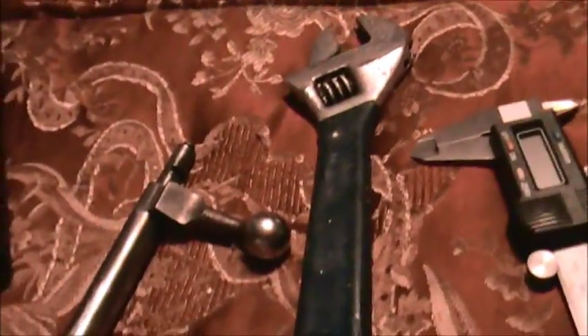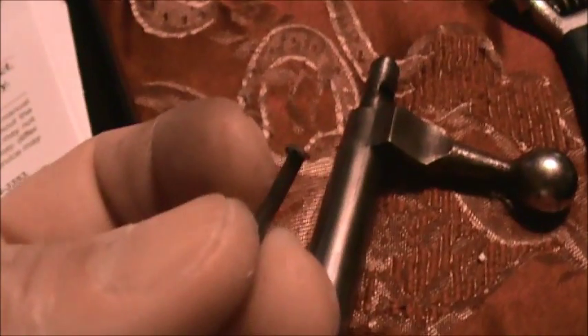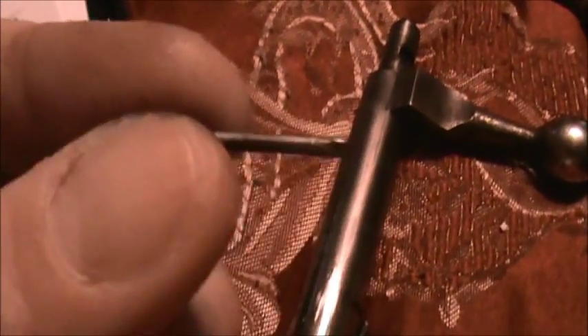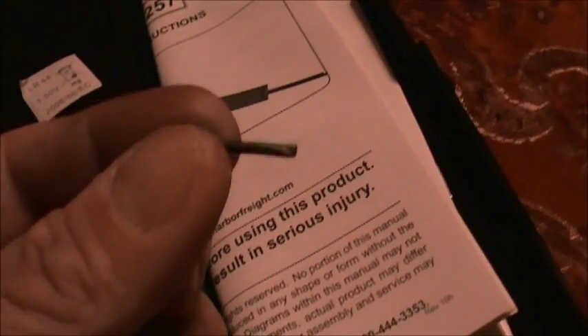So I took the bolt apart. There's a pin that goes through the bolt — you drive the pin out and shake the guts out of the bolt. Your firing pin comes out through that little hole right there. Here's what I found for a firing pin. I think it's had one put in it that's been made. See how it's battered, mushroomed? You can also see it's flatter than a flitter.